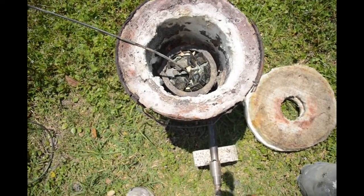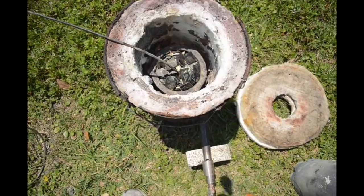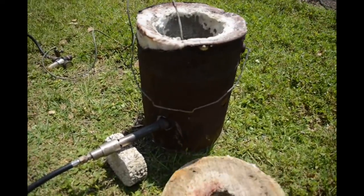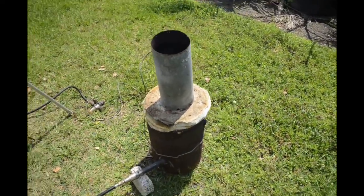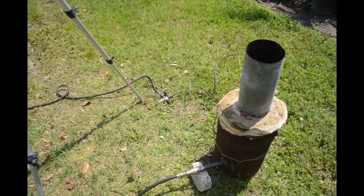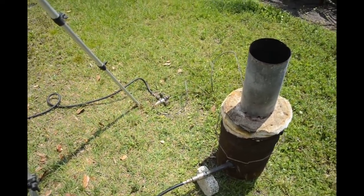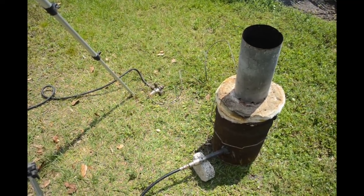We are burning! I've adjusted the airflow on the burner to be as oxygen-rich as it can be before it goes out, to ensure there's some oxygen inside the foundry furnace to help oxidize the chips. Lid on, heat in — whoa, that's hot already. Chimney on to re-burn the smoke gases. Someone in the comments is always going to ask what pressure I'm using on the air. Basically I have no idea because the gauge on the regulator is bad. But I just need a trickle of airflow — pressure is really irrelevant, it's more about flow, and you just need a little bit.